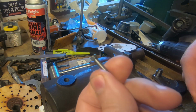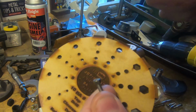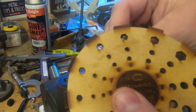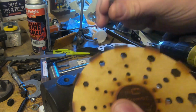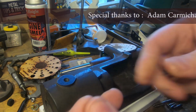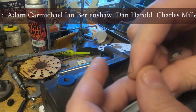Now, 3/4 scale BA bolts come with two different head sizes. If we look at JB's BA calculator on a 4BA, this head he's got here isn't right. This is a 5BA head. So they're small head. You get big head ones and small head ones. The ones I've got here are small head, and that's the most usual ones that are available. They look like real engineering bolts. Well, they are. But they're 3/4 long, and they're only threaded down about 10mm, so that's not enough.